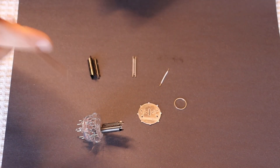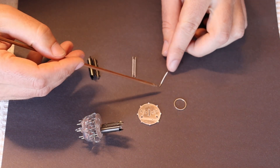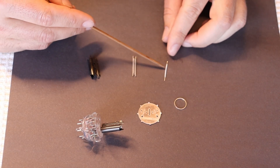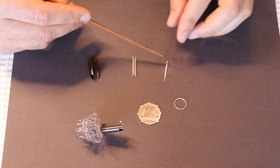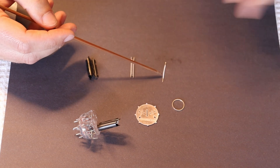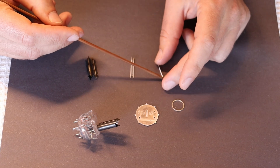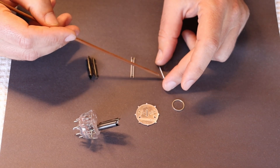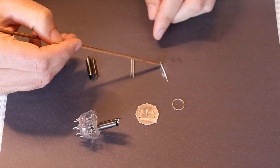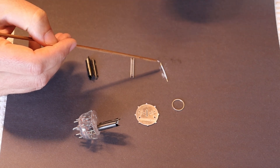So we've taken apart the second triode here into its major components. From the inside to the outside, we have our cathode — and you can see the special coating right here. It's a small component, but this is very, very fragile and powdery. If I rub this a little bit here, you can see that coating is coming right off. And inside this there's the heater wire, which is even more fragile — it looks like the thickness of a human hair.